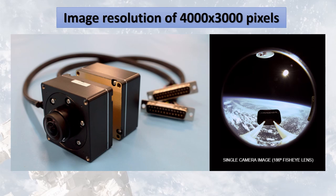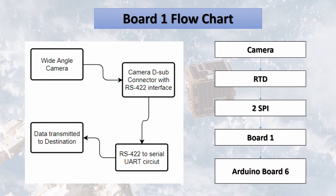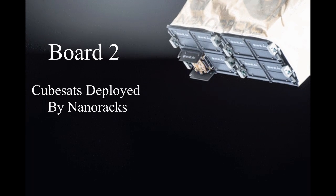Despite many of these attractive properties, however, the device is nonetheless non-standard, and so isn't available as part of an off-the-shelf PCB. Furthermore, the camera's data transmission uses a fairly uncommon RS-422 interface, which requires extra circuitry for processing and conversion to SPI.